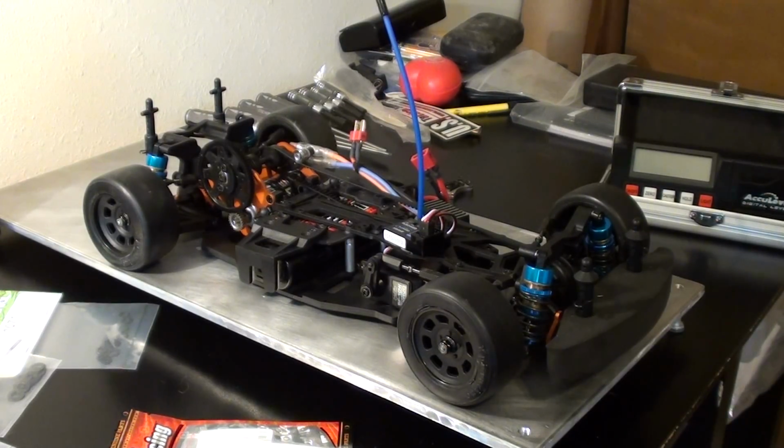And of course, with the shears, electric hand shears, it's hard to get a straight cut, but you can do it like you do with plywood or whatever else. Put your straight edge down there, run one side of the feet, as you will, up against the straight edge, and then you'll cut a straight line.